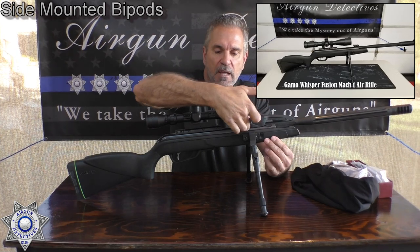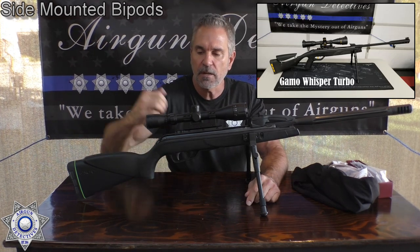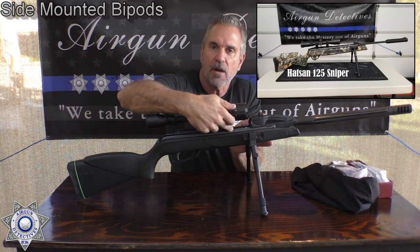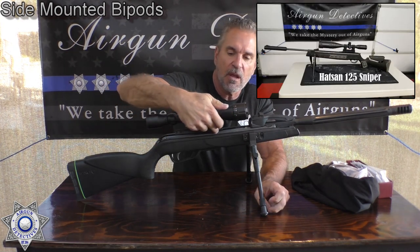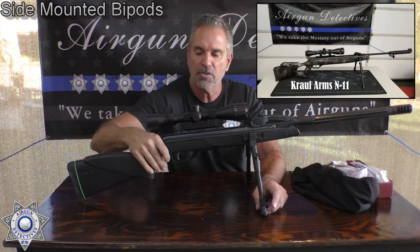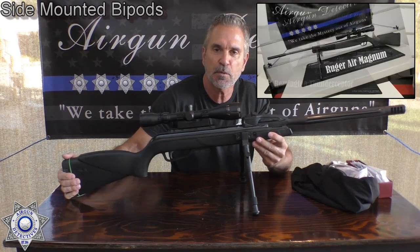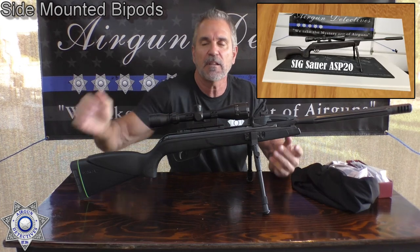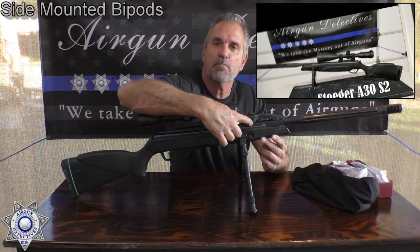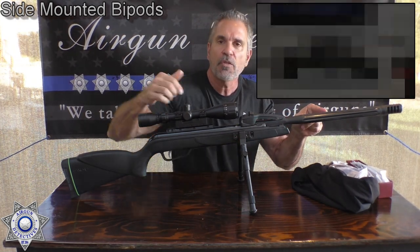As I was saying, when you cock it, the piston comes to the back and it's locked into position with the sear. When you actually release the trigger, it releases this piston. What happens is the piston goes flying forward in this chamber, creating high amounts of pressure. This piston goes flying all the way up and dead-ends into the end of the chamber, and it bounces off the end of that chamber — so you're getting a reverse recoil. When you fire this gun, it's actually throwing the piston forward, so you get a recoil that goes in a reverse direction — forward — then it hits and bounces back a little. As this piston comes forward, it compresses the air in the chamber, and that creates the pressure to push the pellet out of the barrel.